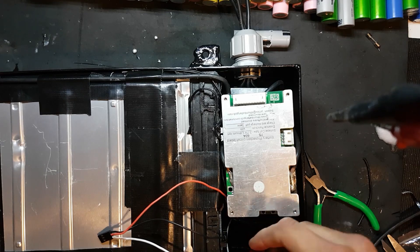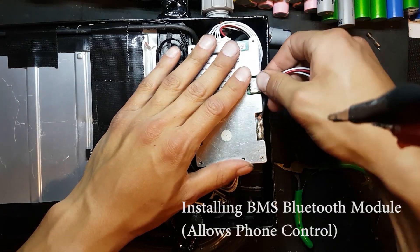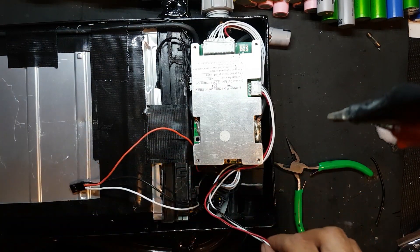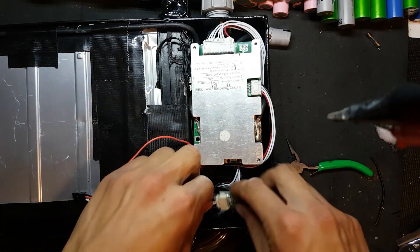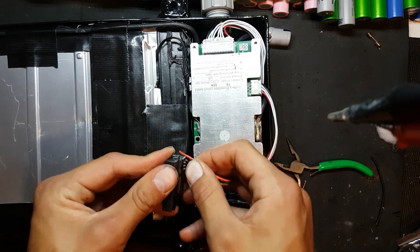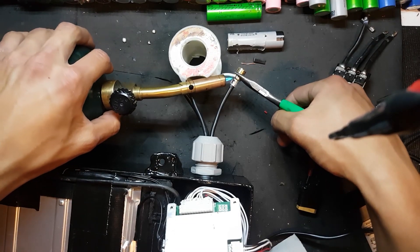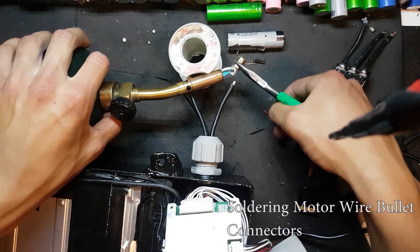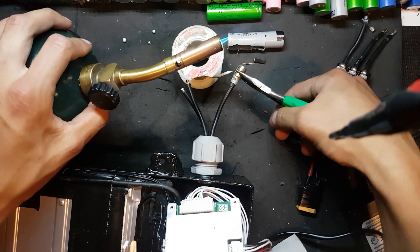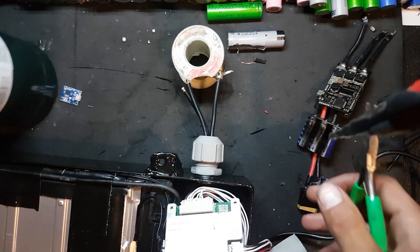I needed a BMS to protect the battery from short circuits, over-voltage, and under-voltage, to balance the battery, and to act as an electronic switch which I controlled with my mobile phone. For this job I love to use the smart BMSs typically found on AliExpress. They give all the features I want, the most important being the ability to charge at 4.1 volts per cell instead of 4.2, as this can actually double or even further increase the lifespan of a lithium pack. As for the battery's weight, I decided to save a little size by shaving off a cell, down to a 7S pack.